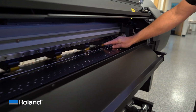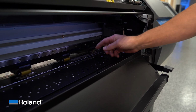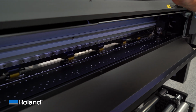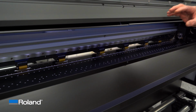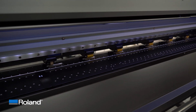And then these pinch wheels going across, the ones at the very end, so this guy and the one at the opposite end, these actually have a taper creating a pull so the material wants to lay flat. These are more for just direct down pressure to create multiple pinch points to increase the precision of the hold. So again, this last one over here is also tapered the opposite direction. So again, there's that pull apart from each other.